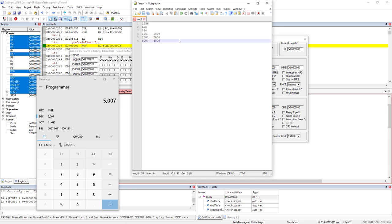For every 1000, we are actually getting 1250 for this particular frequency. If you change the frequency, of course, that will change. So I can easily predict what value I'll get for a particular loop variable. If we use the opposite of that, and I want to create some software delay in my program, I can use this for loop to do it. In the previous tutorial, I showed you how to generate a square wave using this delay. Now you will be able to more or less control the period of that square wave using this information.